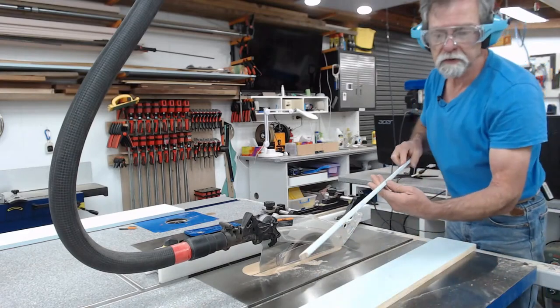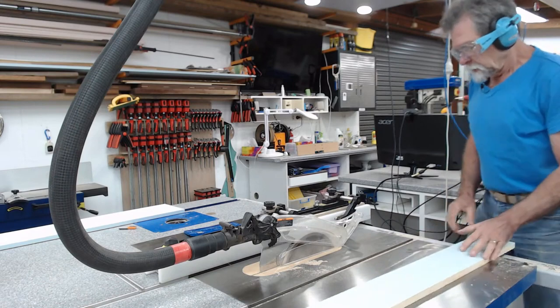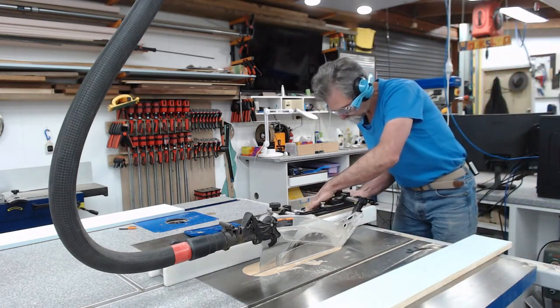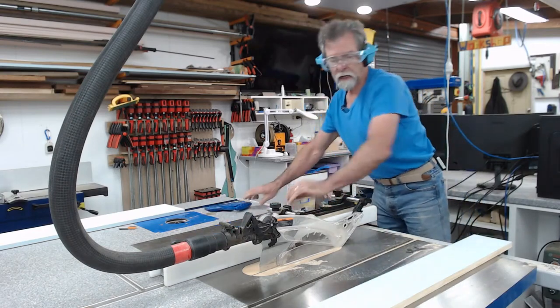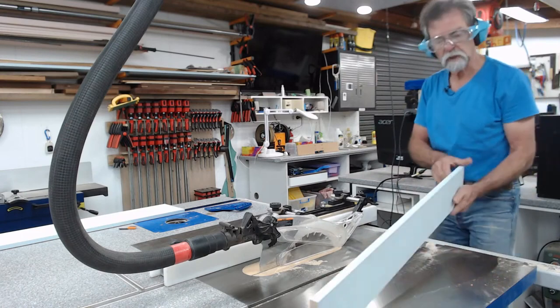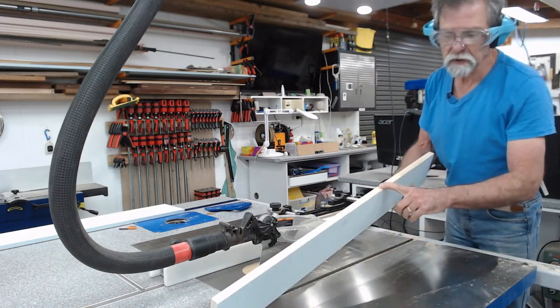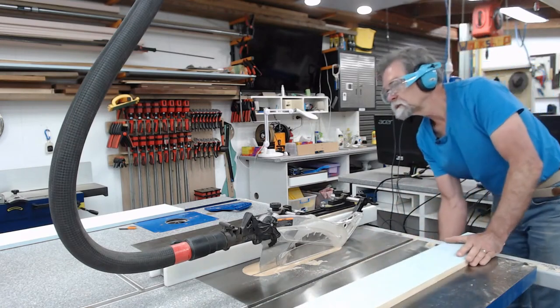All right, that's my bead - so quick and easy. Set it to 95 millimeters. Done - and we'll rip this one and that one. Notice I've still got my nice pretty edge there. This one is going to go to the back but we're actually going to rip that off.